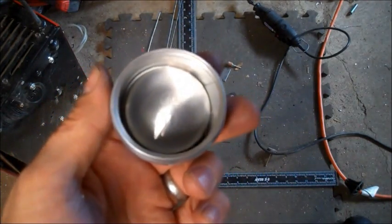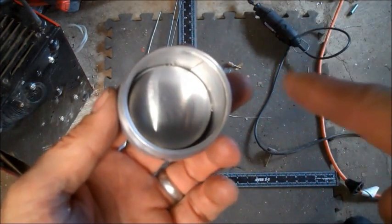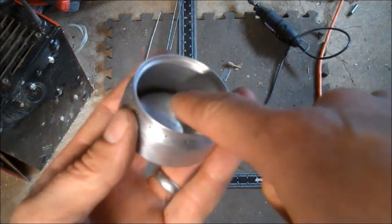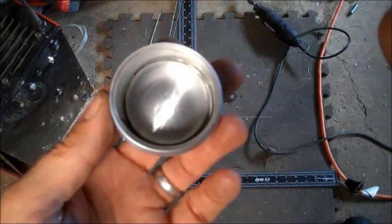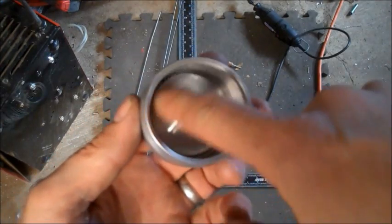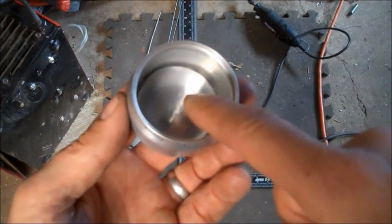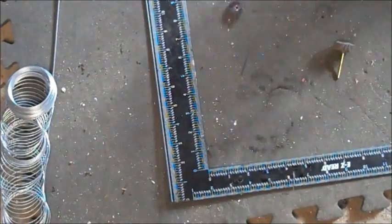One thing I want to point out to you guys when you're watching other stove instructions, a lot of guys tell you to cut small holes or indents into the bottom of the flashing. Don't do that. You're actually defeating the purpose and making your stove less efficient that way. You're not gonna achieve an airtight seal there. You don't have to put those notches in, but by doing that, you decrease your vaporization time. Now the stand is super easy.